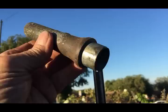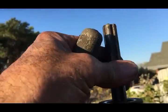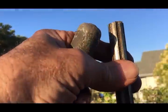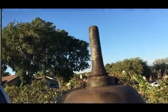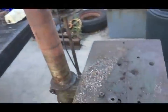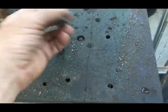On the cover on the spindle drive shaft, sometimes they come up missing or cracked or broken. It looks in really nice shape. Now notice the splines, unlike the Delta's that has like one dog drive that drives it, where the Walker Turners are splined, which I like lots better.